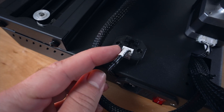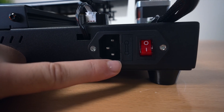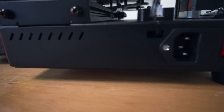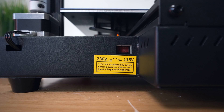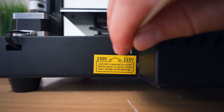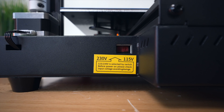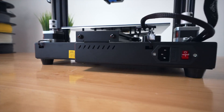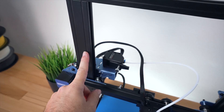Here's the gear for the Y-axis motor located down inside. This is the Y-axis end stop switch. Below that is the power input socket — it is fused with an on/off switch. On this side is the voltage selector switch. It was actually set to 230 volts, which was incorrect, so using an Allen wrench to switch it over to 115. You definitely want to check this because if you don't, you could burn up the printer. On the very bottom there are four large feet.